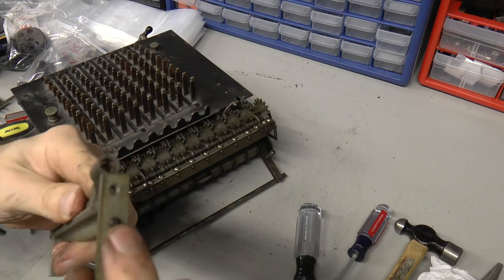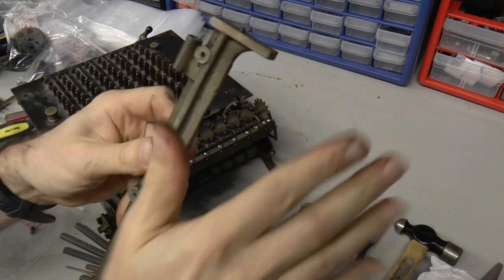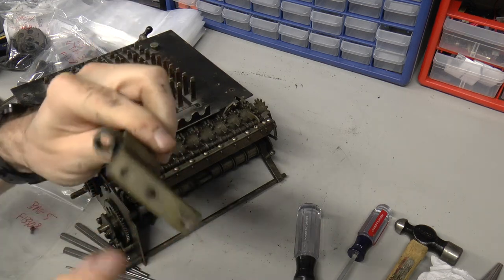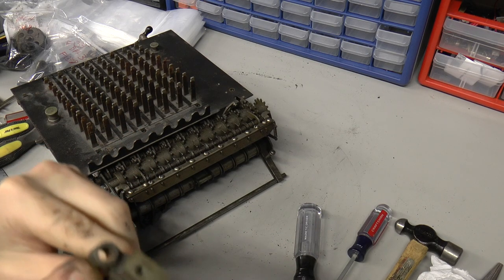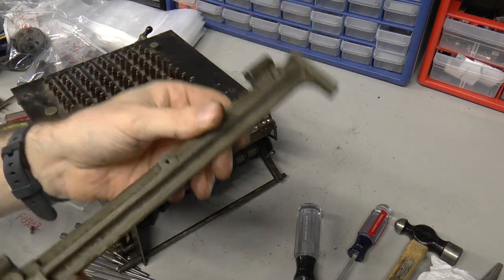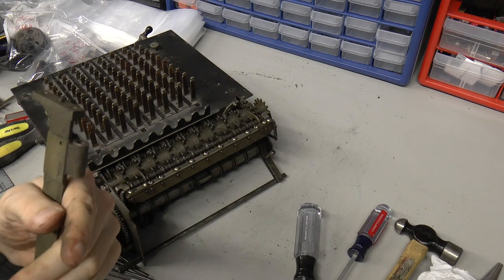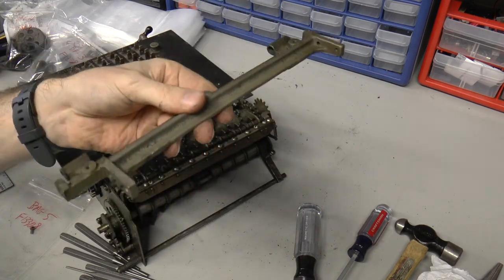With the exception of the pins — there's one pin on this end and two little pins on this end — the rest is basically machined flat where it needs to be, and then drilled and tapped. And then there are these places where there would be an axle — that's where the carriage axle goes through. I guess that would have been drilled and maybe reamed — it's a bit shiny in there. Anyway, that would be kind of fun to model. No markings on it. All right, that's kind of a fun little piece — we'll have some fun with SolidWorks on that.